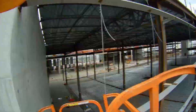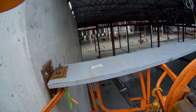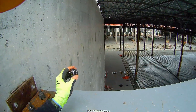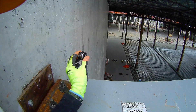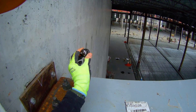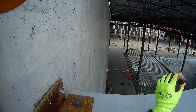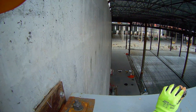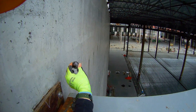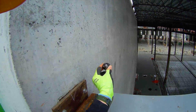I want to take a moment and show you how the indicator lights on the total station work. You're going to use these when you're manually getting a lock with that control screen. The color of the light will show you which side of the prism the total station is looking at, so you know which way to turn it. You'll get a slow blink, and once you get a lock you'll get a fast blink. When I'm trying to get a lock, if I see a green light I need to turn the total station to my right until I'm able to get that lock. Here I'm just demonstrating that color change depending on which side of the prism it's looking at.